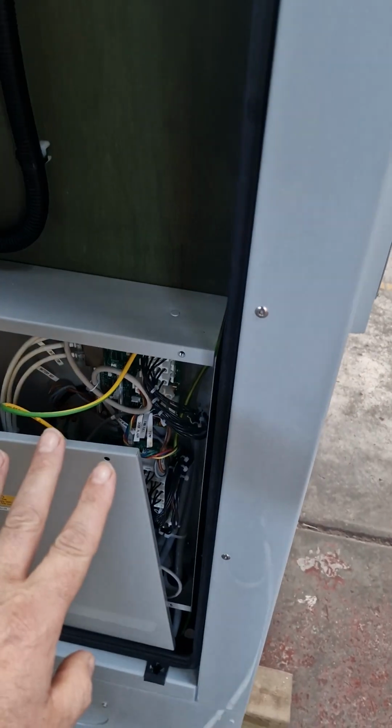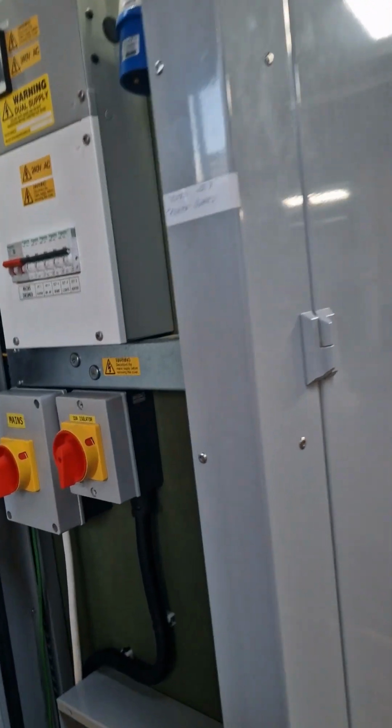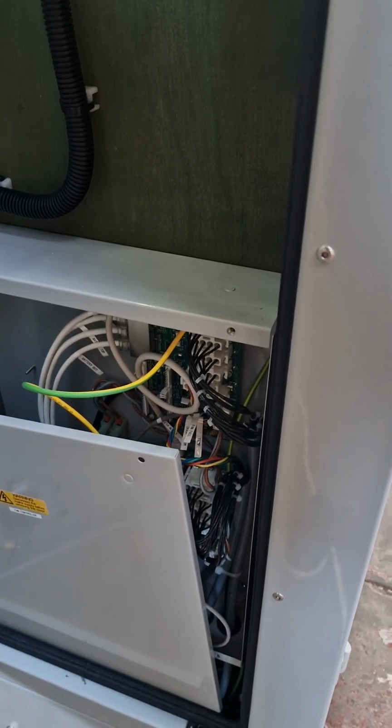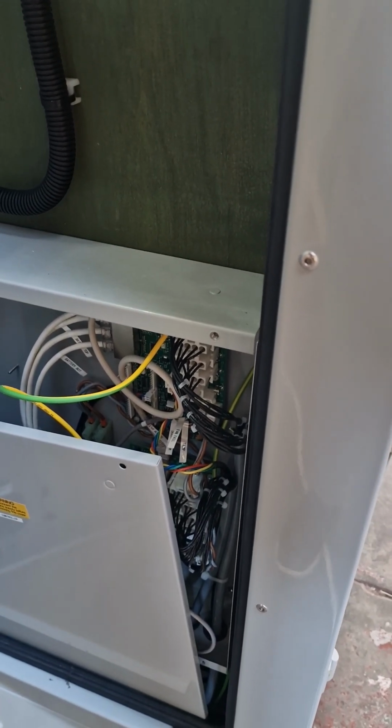We've got here our fan controller, so dual fan controllers, because we've got 4 fans in the one heat exchanger door, 4 fans in the other, plus 1 in the battery chamber, so 9 fans in total. These will provide the alarm contacts, etc., and so SNMP data should it be required.